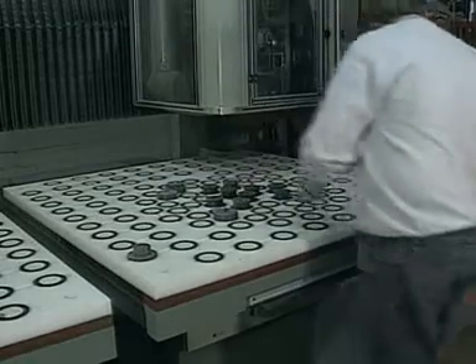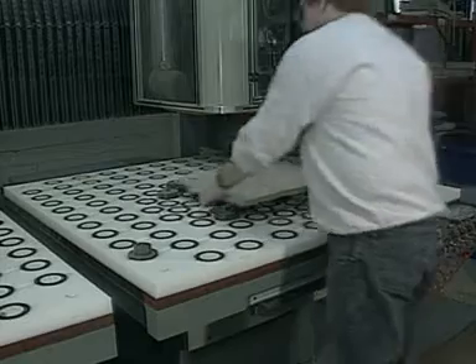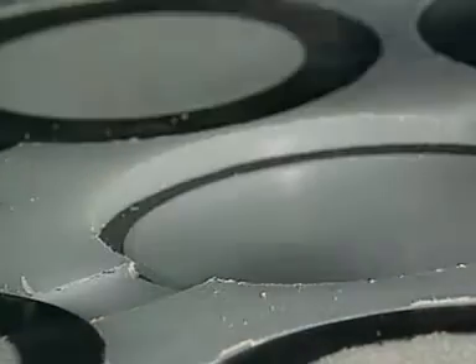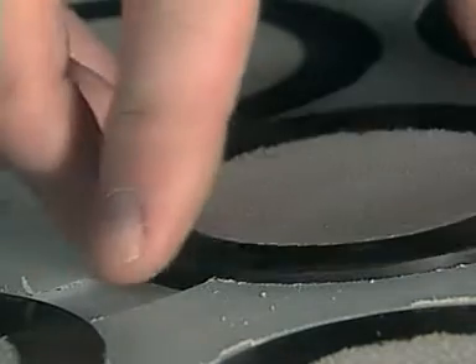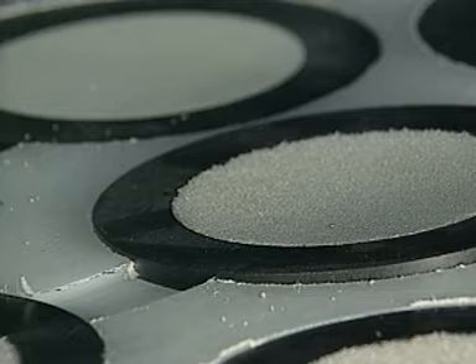In order to flip pods easily from the inactive or off position to the active or on position, you may wish to create finger holes. You can do this by cutting across all the centers of the pods in one direction. Make sure that the depth of such finger channels is less than 0.14 inches from the upper surface of the pod panel — that's important.